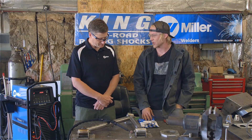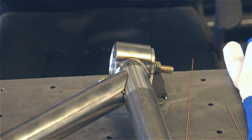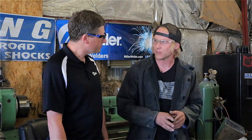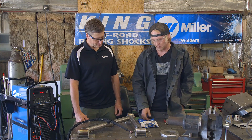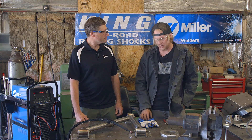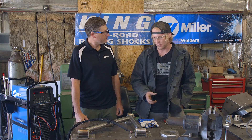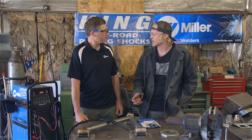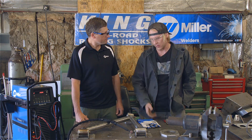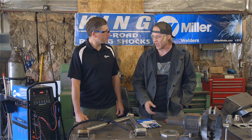It looks like we're building an upper control arm here — what is this for? This is a really basic part in terms of the stuff we manufacture on a daily basis. Typical A-frame construction, no adjustability in it. It actually doesn't have heim joints, just bushings. It's for a four-wheel drive front end, and we really don't want our customers to be able to alter the geometry. The CVs and everything are very critical to it being perfect. So, inch and three-quarter, 120 DOM, TIG welded, two passes — a root pass at about 90 amps, a pulse cover pass at about 250, 70 S2 rod. Our theory is you can't get as much filler material in the joint without destroying the molecular properties of the steel in one pass. Ideally we weld a nice hot root pass, bonding the base of the material, and then get the comparable amount of filler in on the second pass after the part's cooled.